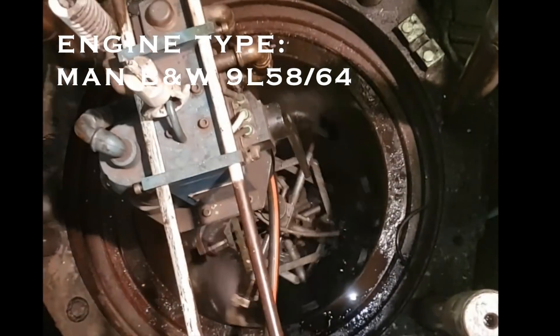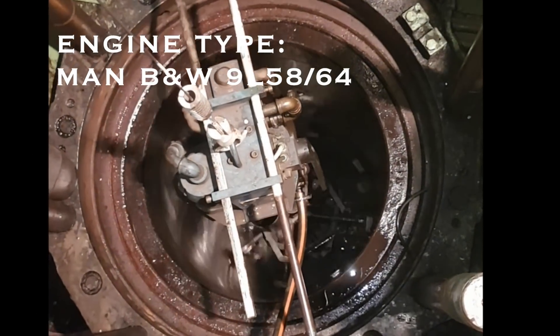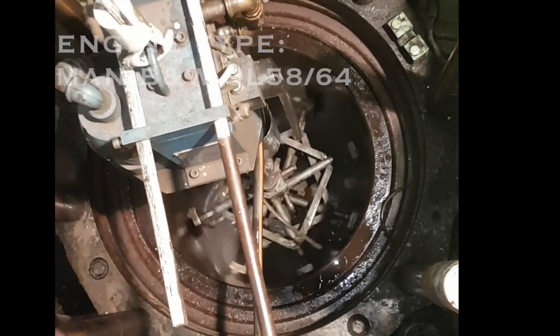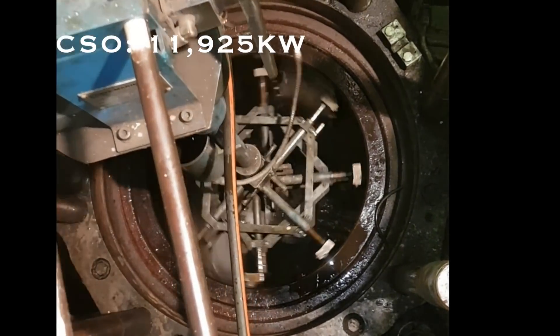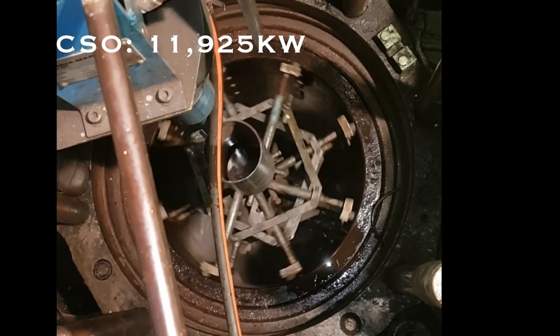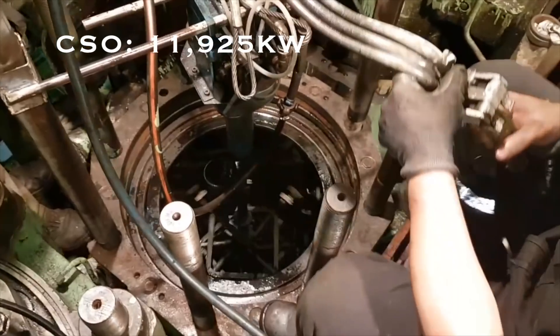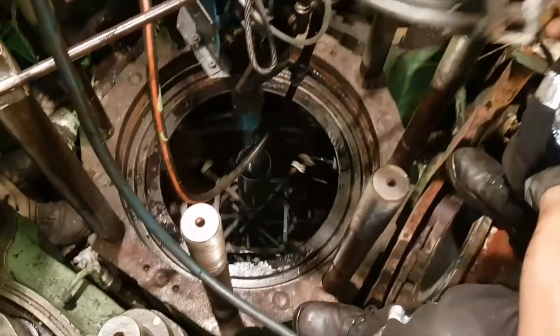This is performing on board the honing process of all the cylinder liners of a MAN 9L 58 four-stroke medium-speed marine engine, prior to renewal and installation of all piston rings. We also replaced number one and number nine liner units due to micro cracks on the upper top section seated area.